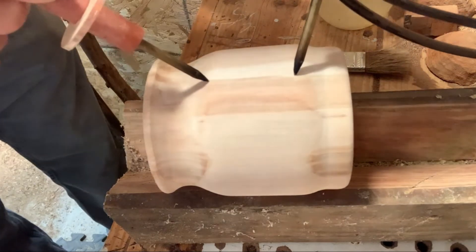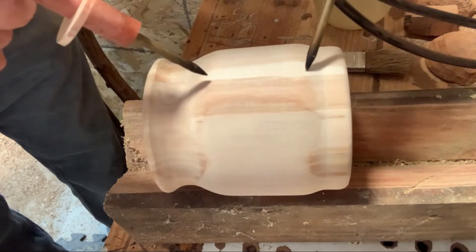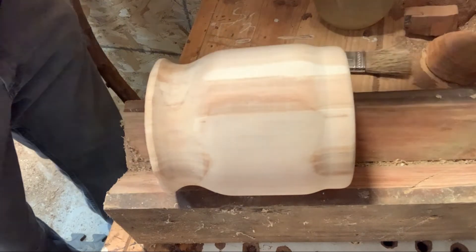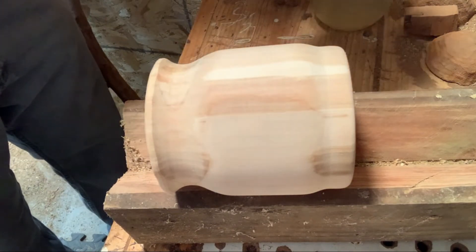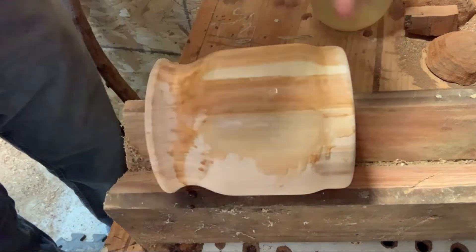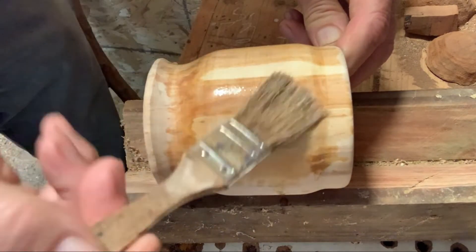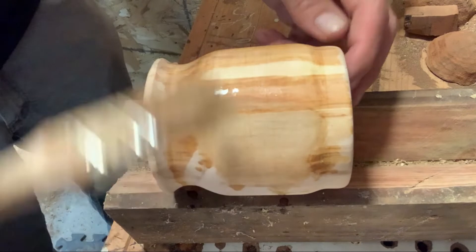I've done this quite a bit and I think I can get it right the first time. But I'm going to show you from turn-on time what happens here, and we will have to rotate the cup. So let me put these probes back in the holder. This will be 15,000 volts going through that, and this is just a water and baking soda solution that I've got on this. That will be tracking. Now this is going to be the main portion of it — right there on the top. So I'm getting more of it right there.